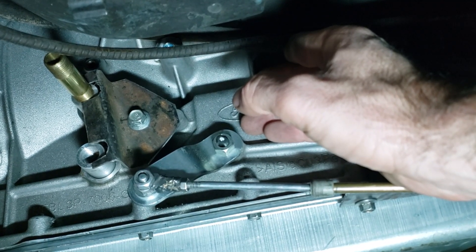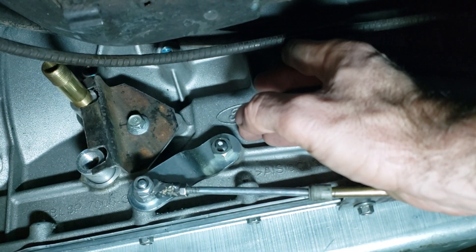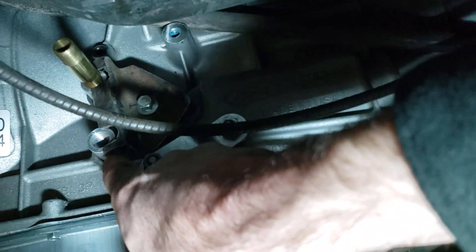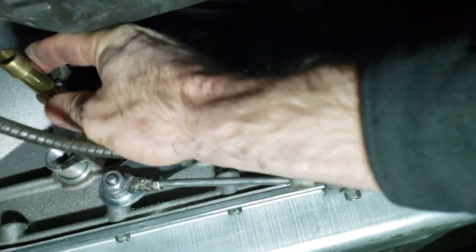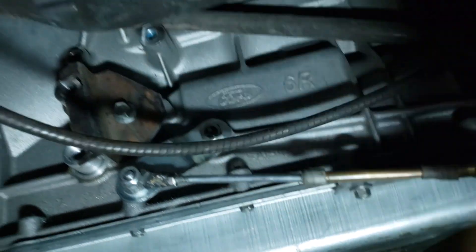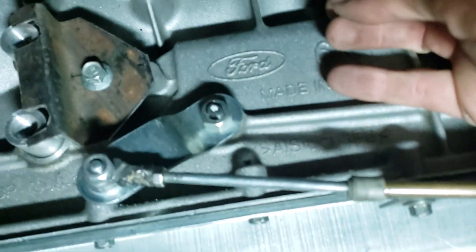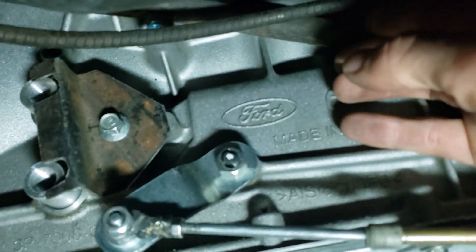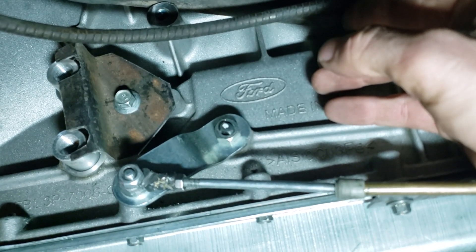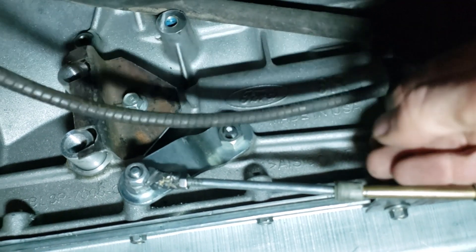I had to mill it just a little bit to get it down to about 19mm minus a couple thousandths — so it's like .745, .744 as the ID of this hole on both sides, top and bottom. This is just showing that the quarter inch NPT threads in. You can see the two fittings I had to fabricate, and then I bent up this piece of sheet metal. It didn't quite come out the way I wanted, but it's currently working since all it has to do is hold those plugs in. I don't think the pressure is going to be high enough to push the plugs out past the sheet metal anyway.